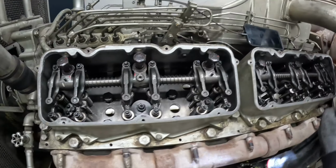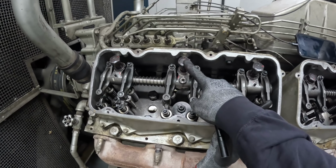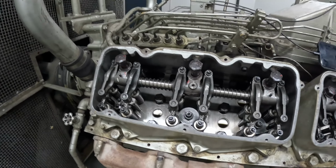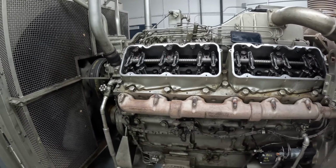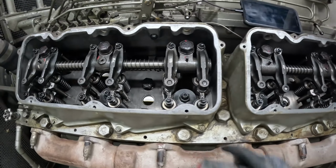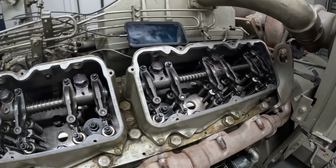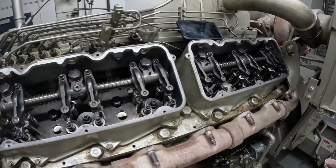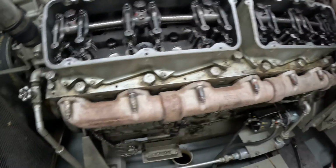And then I'll go through, follow the torque sequence, and get this rocker assembly torqued down. It's 200 foot-pounds, and then follow it up with 330 foot-pounds, give or take 15 foot-pounds, so that's where she's at. Got rockers in, all torqued up. Next, going to put in fuel lines, fuel pass-throughs, and hook everything back up. And then, heck, we'll be ready for cooling. I do believe so. Yeah, we'll be ready to fill this thing up with coolant, run an overhead, and fire this thing off.